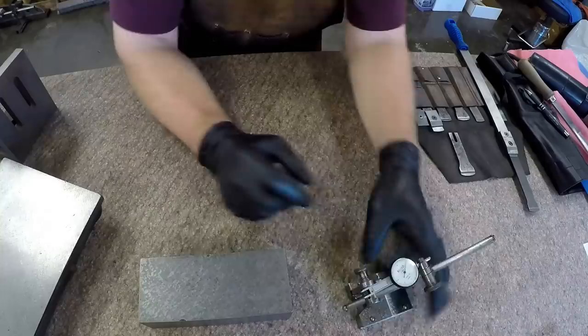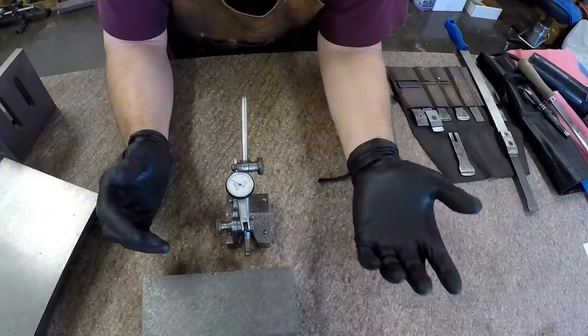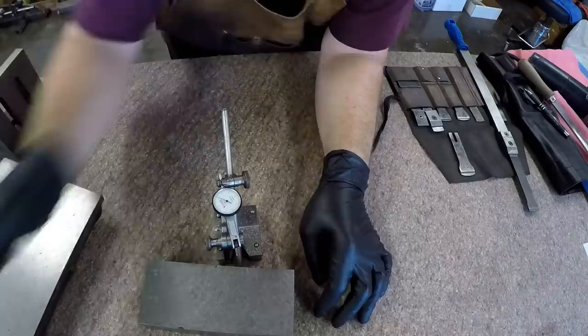and then I can take a surface gauge that's prepped. This is prepped for another thing. And I can run that whole surface, and I can determine if the bottom surface and the top surface are parallel to each other. And I can determine within what error that is over that whole surface. You're talking about sweeping the indicator across. Yep. It would be on top of a little gauge block. Correct. So I'm going to grab your cap over here, pretend that's a gauge block.